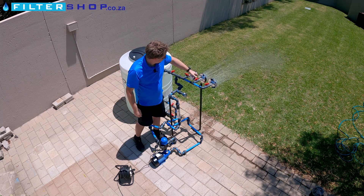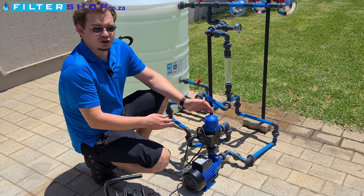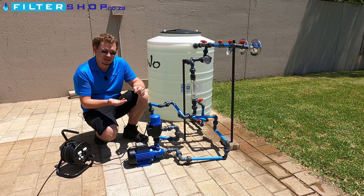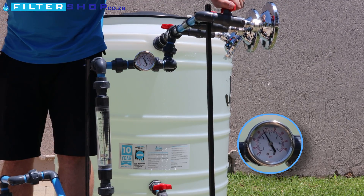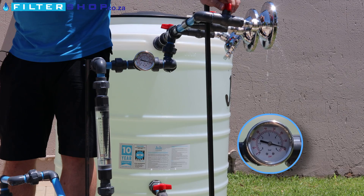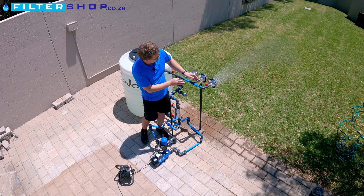One of the things with the pressure switch pumps is that they tend to turn on and off repeatedly, because if there's any water running anywhere they don't stop. The pump turns on at full speed as soon as you have even a slight amount of water going. And if you look at the behavior here — if we quickly open it, we get a little bit of water running, then it turns back on. If we close it and let it switch off, then open it quickly, you'll see it's not immediate pressure — it's not like municipal water. You get a little bit of pressure and then it starts going.